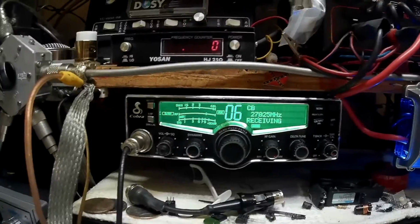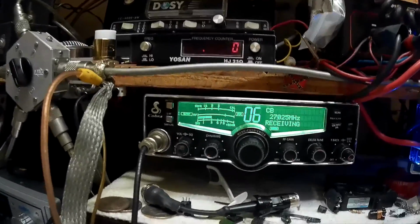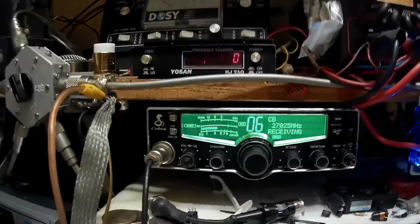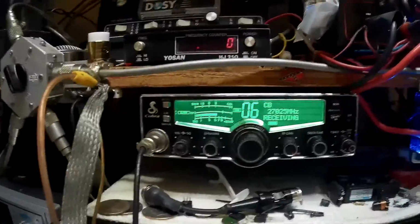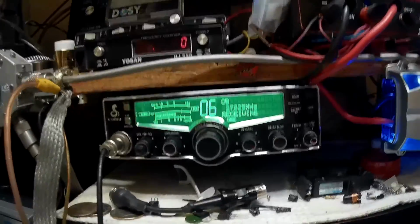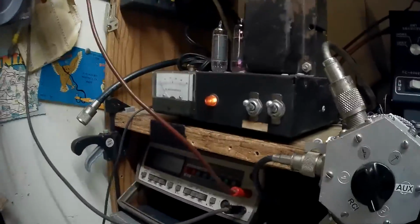I had a few little issues. The grounding, you need to make sure you got everything grounded good. That has a big part. And use ferrites on a lot of your wire if you want to. So far, I've been lucky, and I got this right now hooked up to a little modulator. It does about 25 watts. This radio stock.